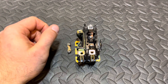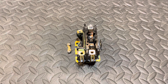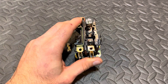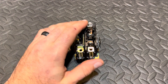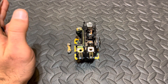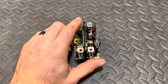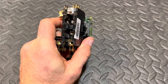If you want to say that the compressors were going bad on these units, I really wouldn't argue with you. Maybe they were. But I do know that as long as we could keep the contactor working, the systems would last for years — it's not like the compressor would short out within six months. These are systems we could keep alive for years as long as the contactor would stay working. So I became very interested in trying to solve this problem and did lots and lots of research.